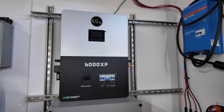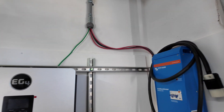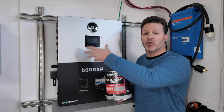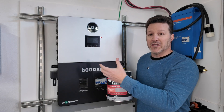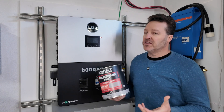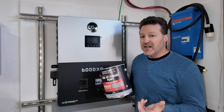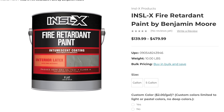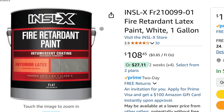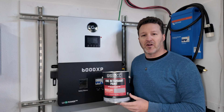It's not a bad idea to fireproof the area a little bit. I ended up doing my whole wall with this gallon of paint and even a little bit of the ceiling, because flames don't stay in one spot — they rise up and start feeding on whatever material is above and around them, so this will help stop the spread. This isn't a sponsored video; I bought this on my own and it is relatively expensive. After buying it locally it was about $150 for one gallon, but I found it on Amazon for only about $115.